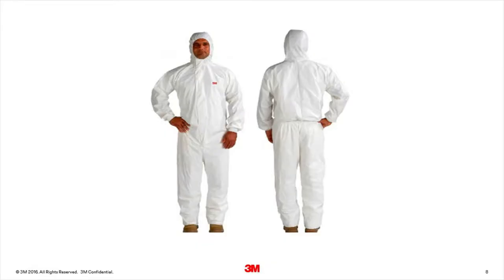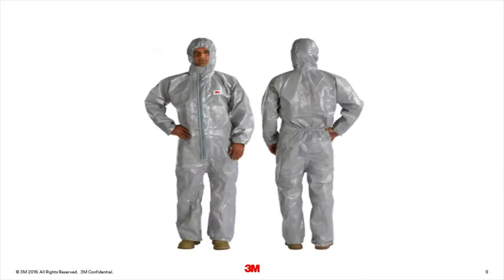Instead of using just one fabric, 3M has different fabrics for different levels of protection. For example, the 3M protective coverall 4545 is a Type 6 and Type 5 coverall for protection against light splashes and particulates, and is made using a fabric which is more breathable than the 3M protective coverall 4565, which is a Type 4 coverall for protection against sprays. This coverall is made from a fabric which is lighter than the 3M protective coverall 4570, which meets the requirements of Type 3 for protection against jet sprays. Another option when full laminates are not required is to use a combination design of splash resistant laminate and breathable SMS fabrics. A dual material design works to help reduce heat stress and increase comfort.